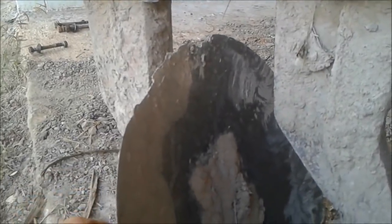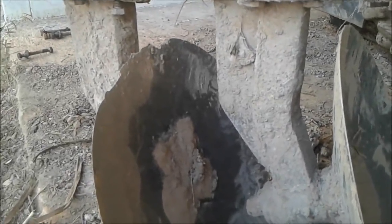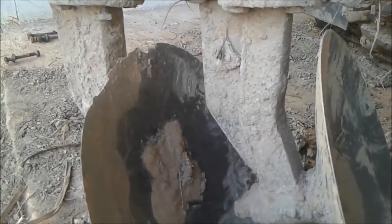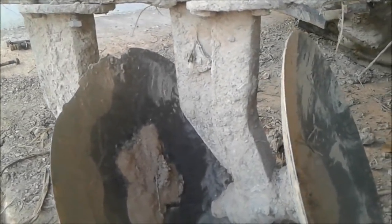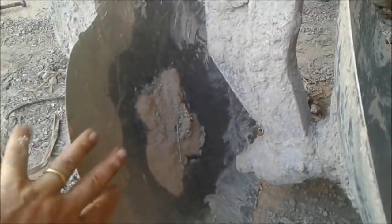The other thing you might have noticed — this third plowing disc is pretty well cut up. There are a few tractor drivers that don't come and work on people's land round here because there are so many stones. A lot of farms have got big boulders in there and you can't see a lot of them until you're right on top of them. If they're just an inch or two under the surface, your discs hit those. The other two are still quite fine — I think this one digs in a little bit more than the other two.